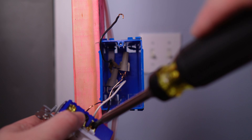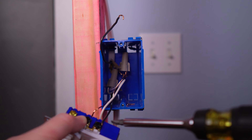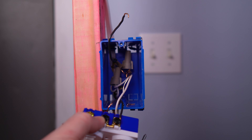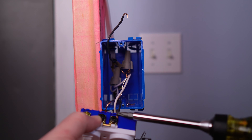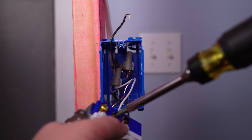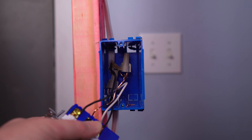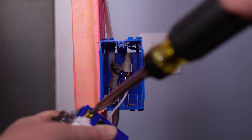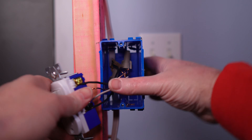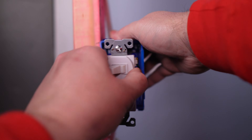You don't want your insulation, if you're stripping it, to go past the body of this outlet, because a ground or something can touch it. You see how mine is cut right there? All copper is touching the screw — the insulation is not under the screw, but copper does not go past this. That's a clean job. Since we're not going to need this and it's tied together, let's just screw this down where it's not in the way of anything. And that is the light tail. This thing is wired. Just fold all of this back in there, kind of get an accordion bend going on.